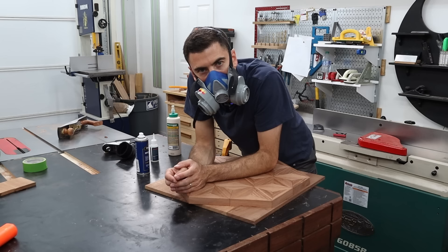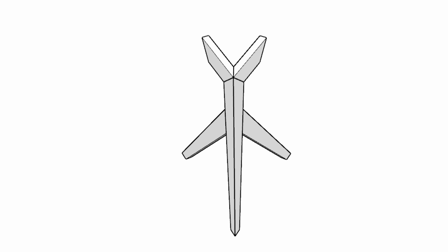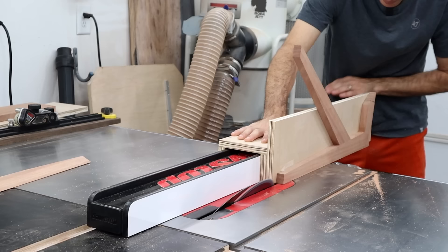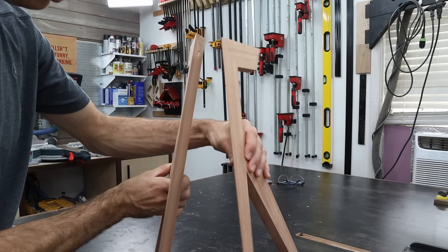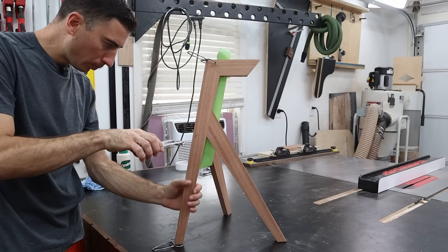That was a really dumb idea. Goodnight. It's officially time for TomorrowJohn's problem. To recap, these two base pieces need a long bevel to splay them outward. Trying to do that up against the fence and feeding pieces through is asking for trouble, so I whipped together this sliding bevel jig, which should take all the sketchiness out of that cut and make it much more accurate. Also, my hand clamps worked like a dream. These are all long grain to long grain, so this is about as strong as it gets. We'll just use a couple of spring clamps and tape to hold it in place while the glue dries.